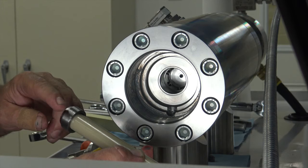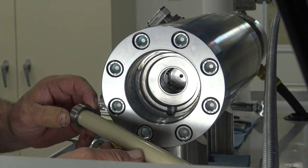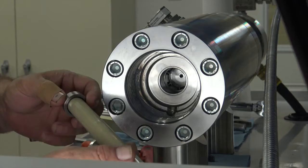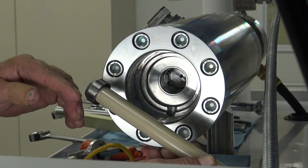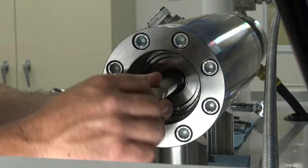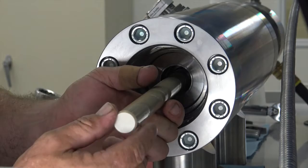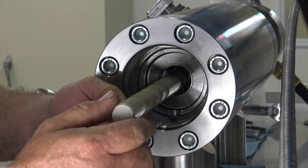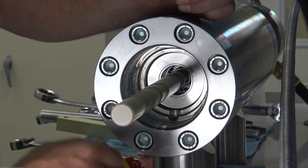The retaining pins in the piston hit on the angle on the plunger head itself. When you insert it, those pins come out and around and snap back in on the face. To put it back in, simply insert it, align it, and either shake it in a circular fashion with your hands or get it lined up and pop it with your hand. Push inward until you hear that snap. Once you hear the snap, look and you can see the pins around the plunger head — if they're snapped into place, you're good to go to the next step.